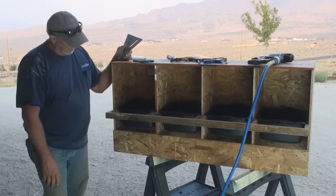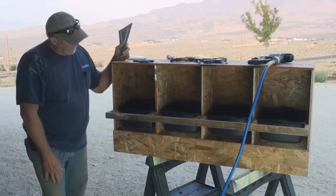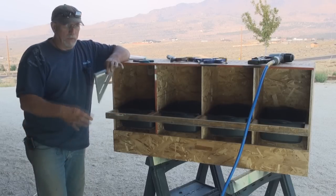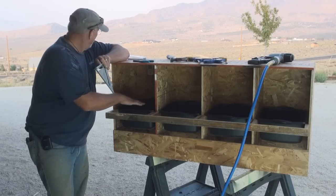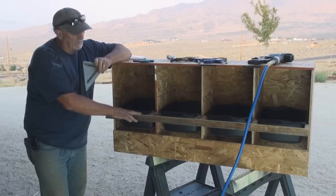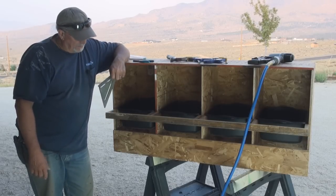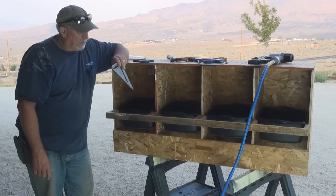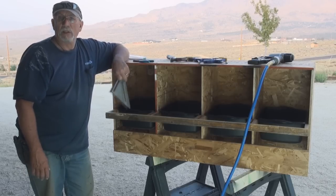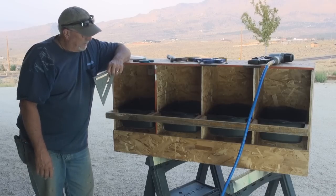The nice thing is this will just sit right on the floor. I put a bottom piece in so I don't want the birds pecking around at the bottom — I want to keep them out of there. The trickiest part of the whole thing was getting all of the one-by-two railing square, level, and installed so that the bins don't tip. Make sure it's level across and square — that's probably the trickiest part. The other stuff went together really well using glue and inch-and-a-half brads with an air nailer, which makes it quick. Now it's glued and nailed, so I'm going to let it set and then prime and paint it.